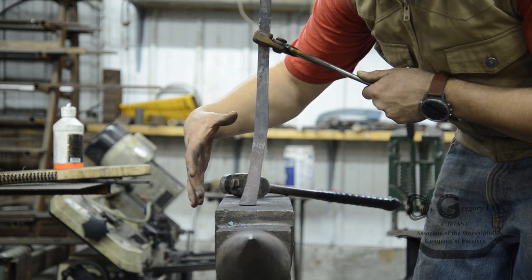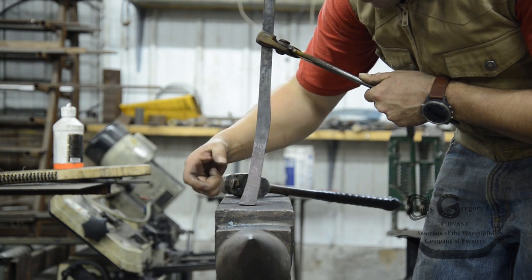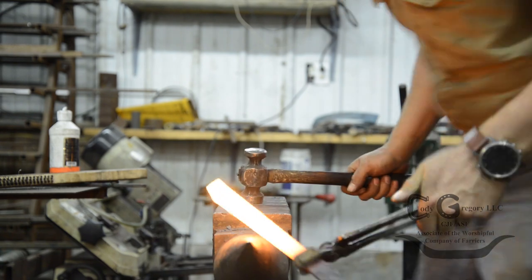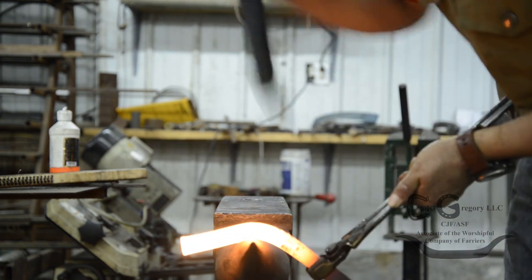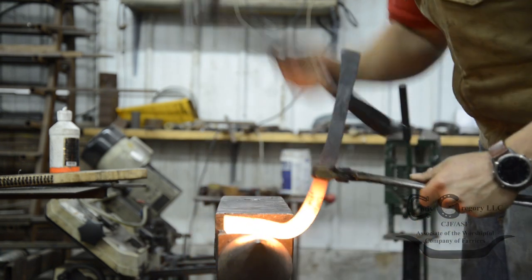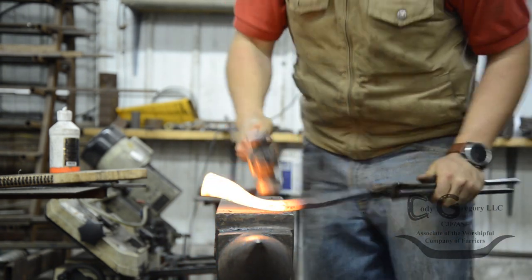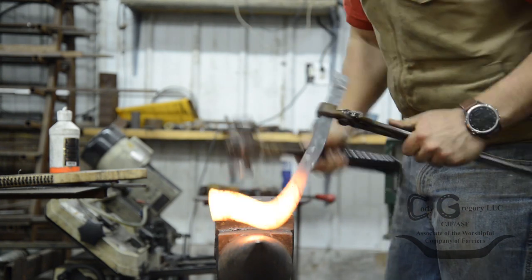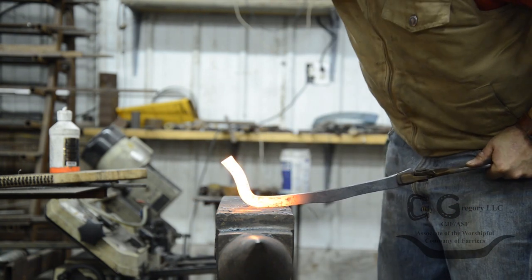As I was putting that one inch in, I put about half the heat from here to here, then quenched it out from here up and put the rest of that bump into that. I'm going to put my mark on the point of the horn and come out and hit with the round side of my hammer. I want to put an S-bend into my hopper — as I hit this it'll straighten out. I'm going to keep that bottom out at about a hundred degrees and we should have about three and a half inches turned up there.